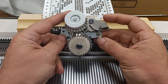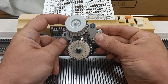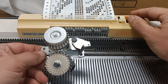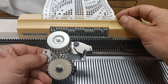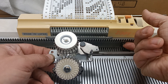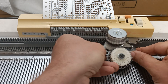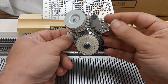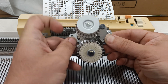The other interesting thing this has is a means of wiping the RAM, which is to push this lever in here and rotate it — it just resets all of the buttons. And then, a bit later on in the program, I can come back and pick up another number. In fact, what happens on this particular machine is that every time the carriage goes past, it picks up another number. So let's store this number on here — and there you go, you can see we've stored another number. It's time to wipe it. And that is the basis for mechanical RAM.